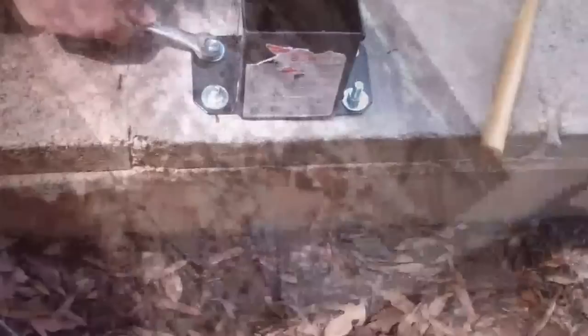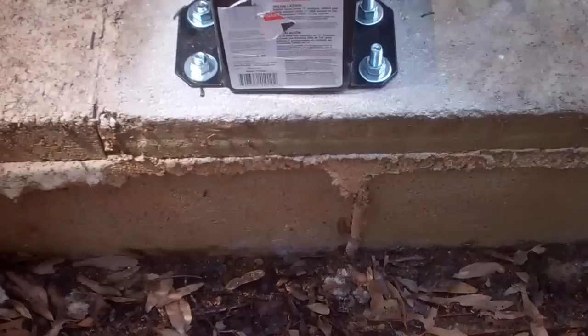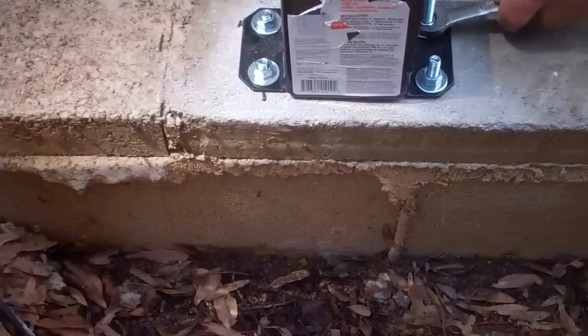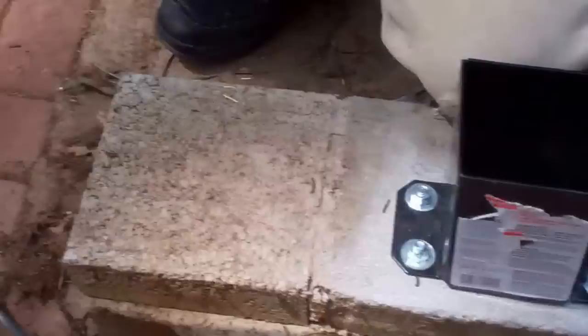We got some that are anchored and some with nothing in there. They'll still anchor, but they'll anchor to the bottom of the cap block — it's not solid all the way through. They're coming in between two bricks. We probably hit the hole that was in between those two cinder blocks there. Well, that happens. Three out of four — not bad. We'll probably figure something out. It's still grabbing, no doubt about it. We got a post in but it's not all the way down; it looks like it's swelled up a little bit. I guess we'll commence to beating it into place.